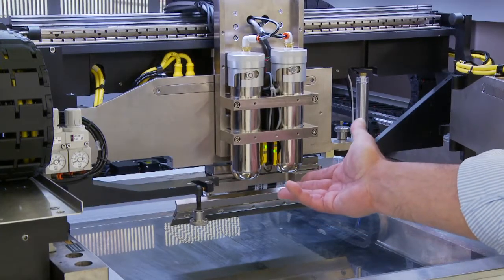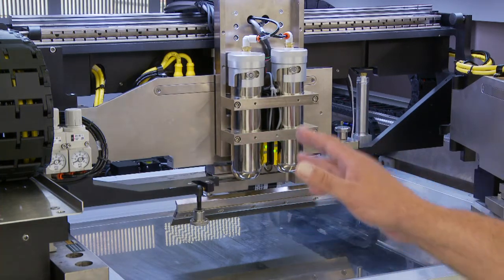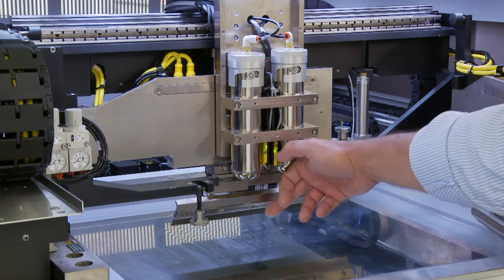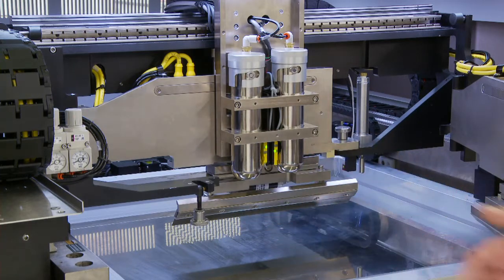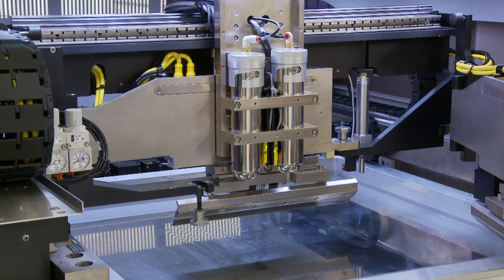Milara also offers a solder paste dispensing system, same as our competition. However, we've taken the next step by actually dispensing the paste in between the front and the rear solder blades. This way, as the machine is printing, the paste is actually rolling into the solder bead, thereby producing a paste knead function while you're printing. This eliminates additional cycle time that's required for that operation, so once again we've taken another step forward in printer technology.